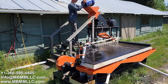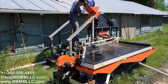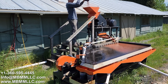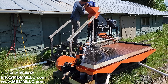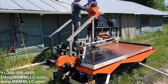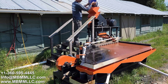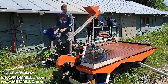We do these demonstrations to show customers how the equipment works with their ore, their samples, their rocks. We do take samples off the shaker table and send them back for analysis, but what this sample is not very good at telling the customer is the percent recovery — how much gold, silver, or values are in their ore. The hammer mill and shaker table, even though we do our best to keep them clean, we cannot guarantee all the values have been removed from the system. I run samples through this, Dan Hurd's run samples through this, we have customers that run samples through this — so I can't guarantee that what you get in number one and number two is the actual value of your ore. I just wanted to put that out there if you're thinking about sending us a sample. We can show you how the equipment works, but it's not a good way to determine the value in your ore or what our equipment can recover.